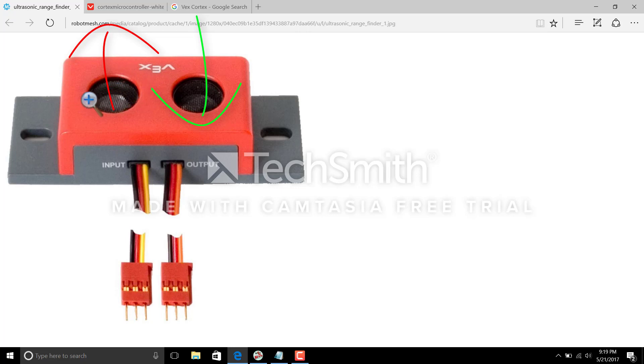What these sensors actually do is measure the time it takes for the echo to come back. It emits the sound pulse, the pulse gets reflected, and the sensor times how long it takes for the echo to return. That's how the sensor knows the robot is, say, 20 cm or 20 inches away from the object in front — and that's how the VEX ultrasonic sensor works.